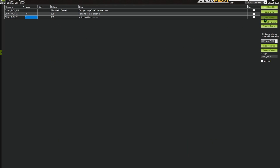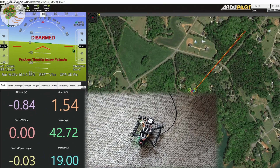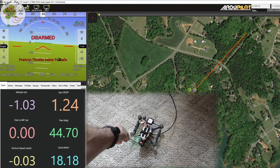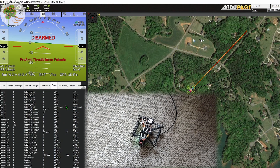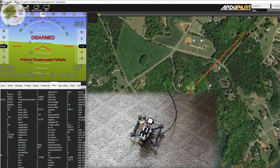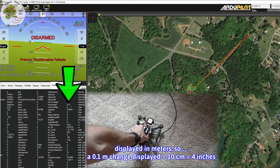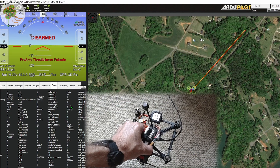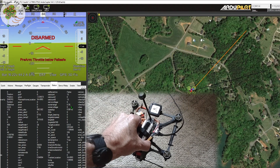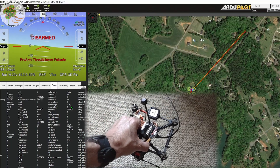Remember to write your parameters. Now let's test out our FPV drone LiDAR to make sure it's working. Connect your quad to Mission Planner with your LiDAR powered on with your LiPo battery and props off, go to your data window, status tab, and scroll down to the sonar range reading. While watching that reading, simply move your quadcopter vertically up and down from the ground and see what the sonar range is reading. You should see these numbers change corresponding to the distance measurements of your LiDAR rangefinder. If you do, it's working. If you don't, go back and check all your connections and setup parameters.